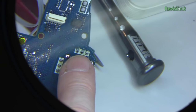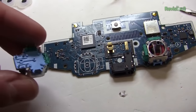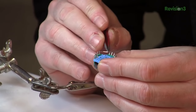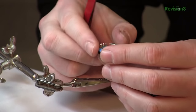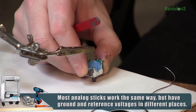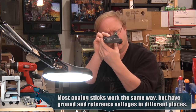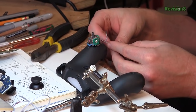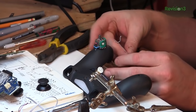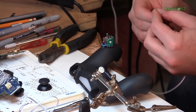That way it gets all the solder flowed and fluid before you actually try to suck it out, otherwise you won't get it all. It's a rule of thumb — if you can see empty space around the pin, that means it's good to pull out. I've taken the analog stick and tied the positive ends together and the negative ends together. So when it's actuated against your leg, that's left, that's right, that's up, and that's down. We need four wires total: ground, voltage reference, and then horizontal and vertical. I'm going to attach these three wires here and then loop this one around and then hot glue it so it'll stay secure.